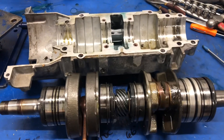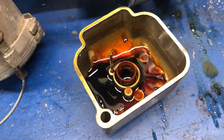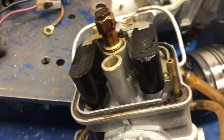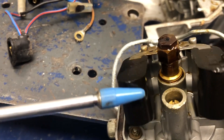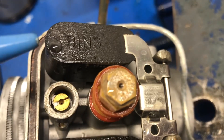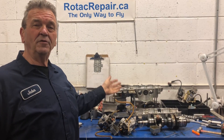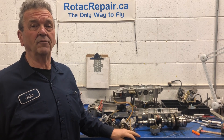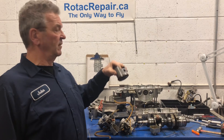All in all, no big surprise — I knew it was going to be rusty, just didn't know how rusty. The last thing to look at is the carburetors. Here's the bowl off the mag carburetor — there's some goo in the bottom and it's clogged up in the main jet. Check this out: single-hung floats — really old school. There's water in the bottom of the bowl, water inside the main jet, and water on the float. So there we have it — a 532 engine, historic piece of equipment.